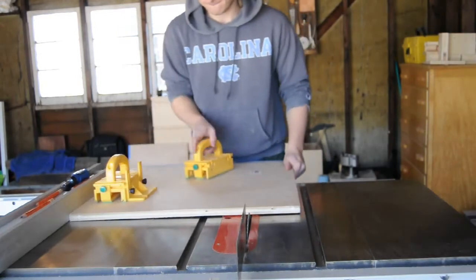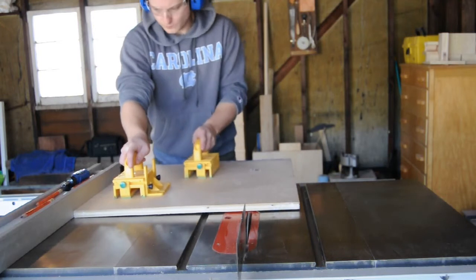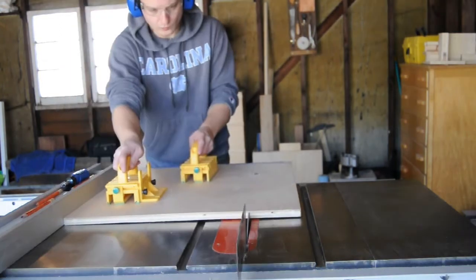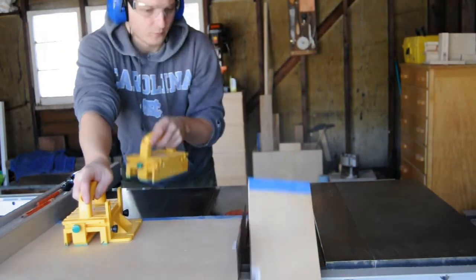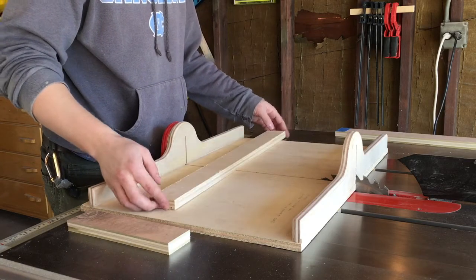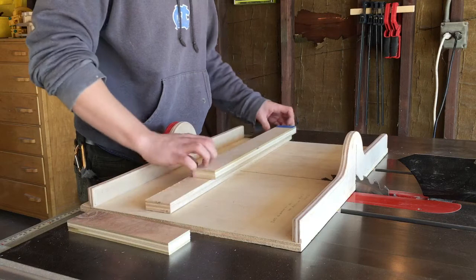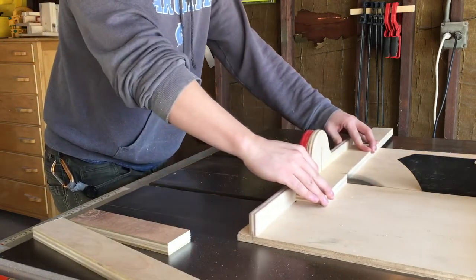After cross-cutting I ripped the plywood to make the top of the box. I used a cross-cut sled to make the three shallow sides of the box — I didn't bother including a fourth wall since it would just get in the way when reaching underneath the table. Since the remaining three sides are all bolted to the table saw I'm not too worried about structural integrity, so I'm not worrying about the cuts being super precise. As long as the top is the correct dimension everything should work out.